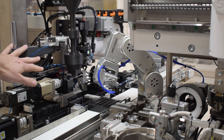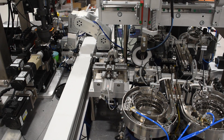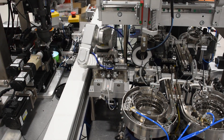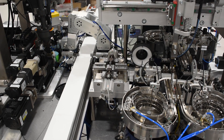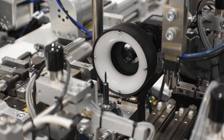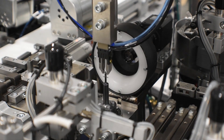There's a total of 26 links and 52 rivets per assembly. Each link has two rivet insertion locations. Every time we insert a rivet, we have to orient the link to the rivet due to the super small clearance that we have — on the order of a thousandth of an inch of clearance between the rivet diameter and the link hole.